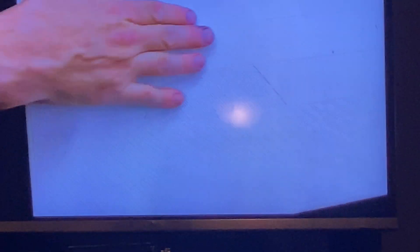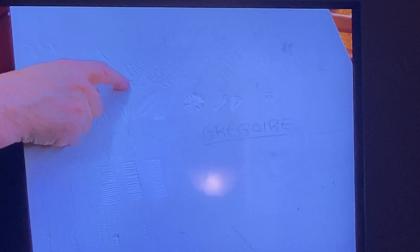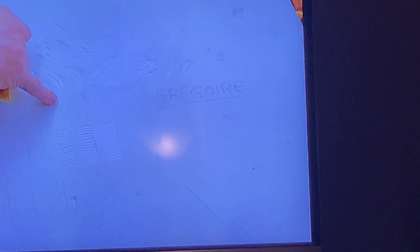Let's move to one more panel — this was my practice panel when I was in France as an apprentice. I did the same thing: 21 coats, smoothed it out, super smooth. That's me — Grégoire en français. These are all different tool marks by different tools, and this is a carving tool for cutting plaster — carved on the pull, not the push. A pulling motion. I'll show you that motion in just a bit. Creating lines, cross-hatchings like on our Louis XIV and XV frames. This is a great practice board — I had about 10 of these over the course of two years. It's essential to apply gesso, smooth it down, and know how to do the recutting, because we don't want to lose all the great detail of the frame carver.